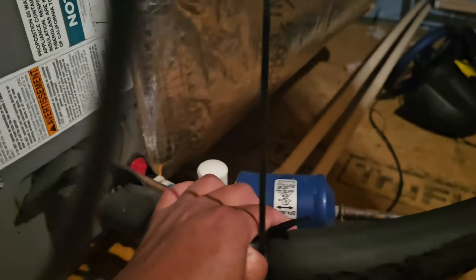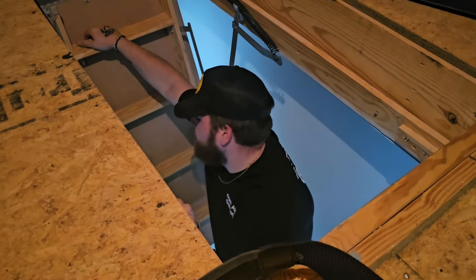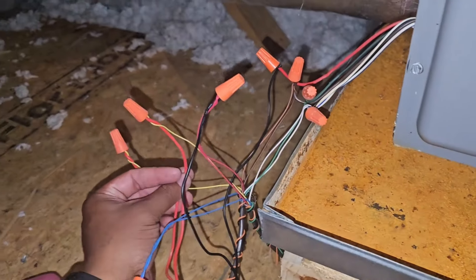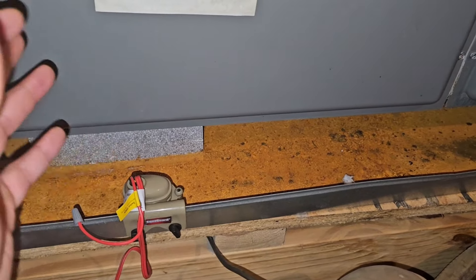There's a filter dryer up here and they have a float switch. It won't go below 68. It's a Honeywell T6 — you've got to hold the home button and the plus sign to put it in test mode, then go to cool stage one. The float switch is tied to R — so if the primary drain backs up through the P-trap, it'll fill and break R. If something else happens and the pan fills up, the pan switch breaks Y. The safeties will still stop the system from making a mess.